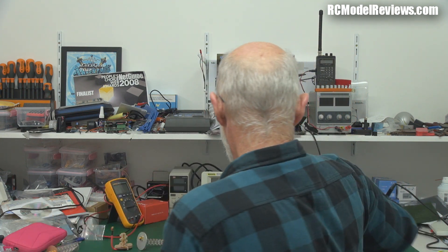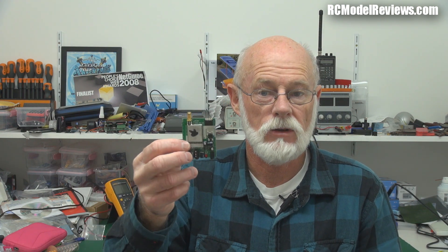The big question was: how am I going to test these? I have a spectrum analyzer, but it only goes up to 3 GHz, and we're talking 5.8 GHz here. A spectrum analyzer that reaches 5.8 GHz costs far more than I have. So what I've decided to do is use one of these RC305 receivers which has an RSSI output — received signal strength indicator — and measure signal strength as I try the different antennas. This gives at least a relative comparison between each antenna.